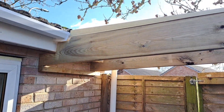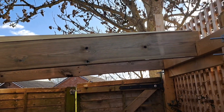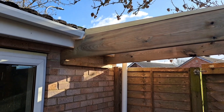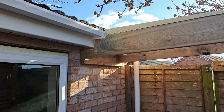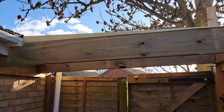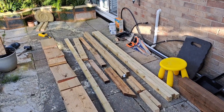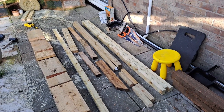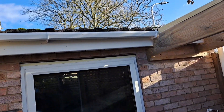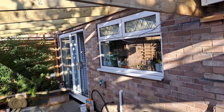The other one I've done is already up here, not tacked in yet but you can see what I've done. If I used a normal bit of wood it would bring the right-hand side up too high, but because it's so thin at that end it still has a fall while taking me up over the gutter. So I'm just going to tack these bits in to stop them moving while I work on them, and then put those top wedges on. Using whatever spare bits of wood I've got down there, I'll put some struts across to give me something good to fix the roof to.